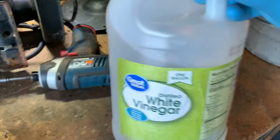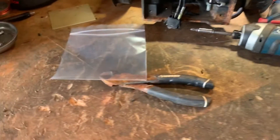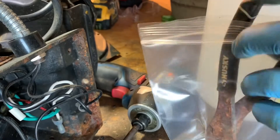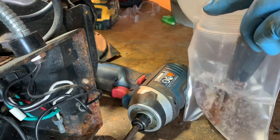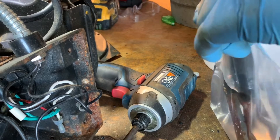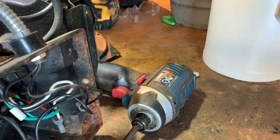To do that we have a plastic bag and half a gallon of white vinegar. I'm in the process of restoring and fixing this up, making it look better, so I might as well soak some other tools in some white vinegar and see what happens. Obviously I can't fit the whole thing in there but it just needs to be in there enough so that the vinegar coats all the rust parts. That just barely fits, but it covers everything that we needed to cover. It's not gonna harm that rubber, so we're just gonna set this in here with the rest of these parts that are curing.